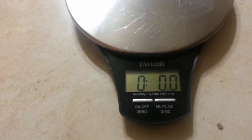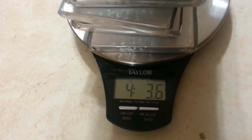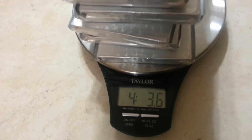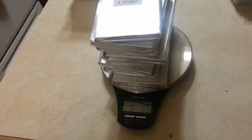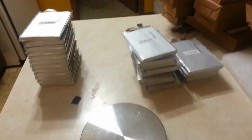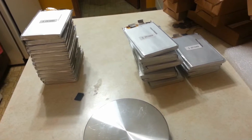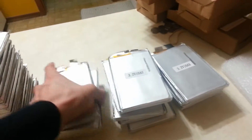That's one very big reason. The other thing is that these things are light. I'm going to put them on the scale here — sorry for you European folk, this is in pounds. Let's say I use eight of them, which is 27 volts or so, so 4.4 pounds. Let's say I have two of these, so you're looking at not even nine pounds. All of these together are probably 13 pounds, something like that. A regular lead-acid battery, a car battery, is 20, maybe 30 pounds, maybe more.